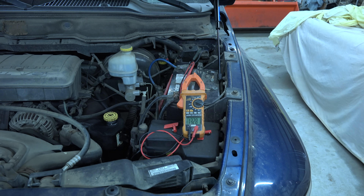What I'm showing here is a battery with a meter in front of it showing 13.28 volts. This is a car starting battery for a truck, and it's fully charged. 13.28 means it's pretty much topped up, charged as much as it's going to charge. This has got all the power in it that I can use. What I'm trying to demonstrate is how much power this thing can actually put out.